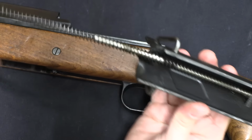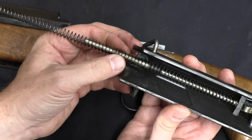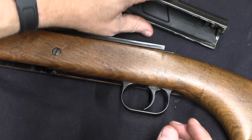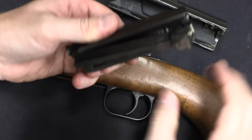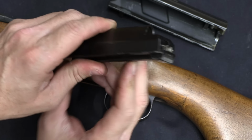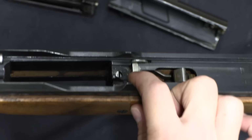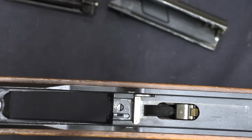You can see we have a two-part recoil spring inside here. So there's a connecting guide rod in the middle. This lug, this spring right here, this hook, is what actually locks the bolt into that bolt cover. So I can now pull the bolt carrier out. This has a tilting bolt, so that's the traveling position. That's the locked position. That surface right there is your locking surface, which locks against this nice shiny locking lug right there, locking block in the receiver.